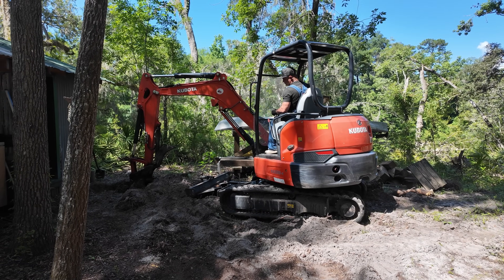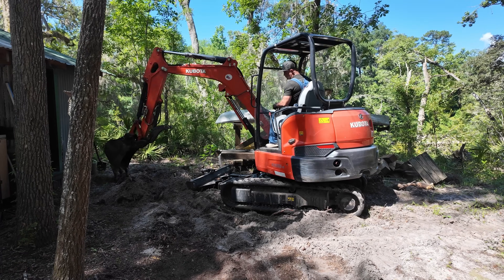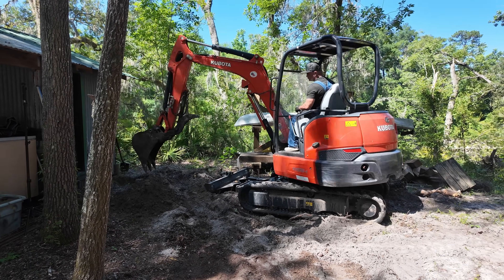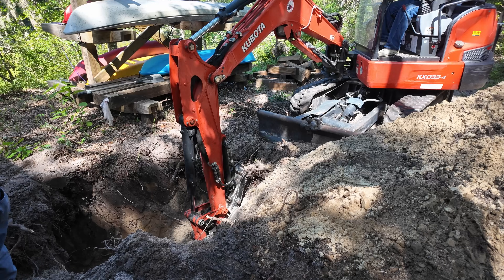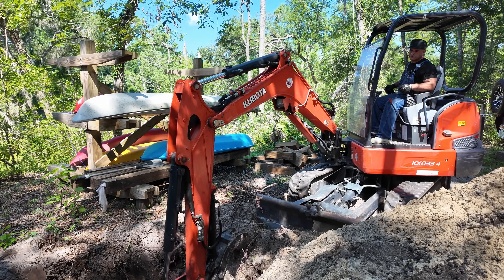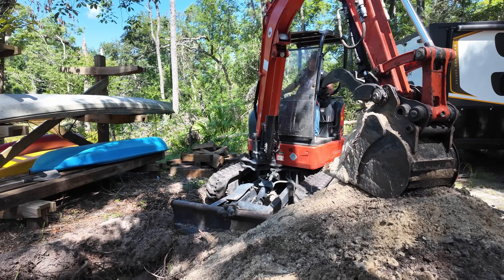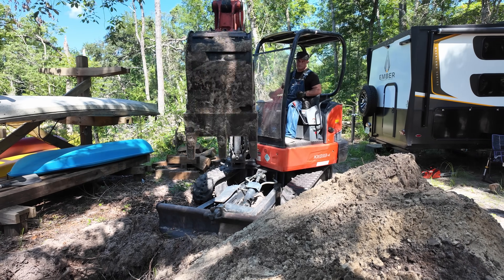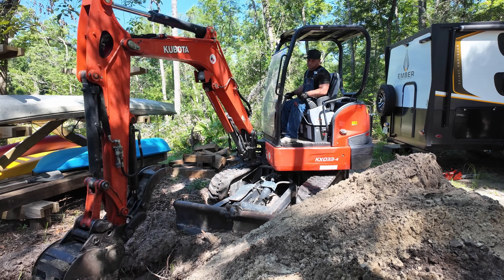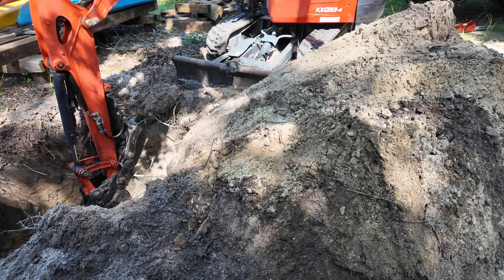The first thing I was doing with the excavator was throttling it down extremely low because I'm really close to a lot of other elements — RVs, trees, walls, and there are a lot of people around. You want to make sure the throttle is completely down and you take your time when you're digging, making those scoops as efficient as possible so you're not making any mistakes or over-correcting.